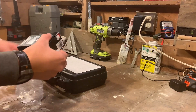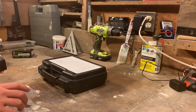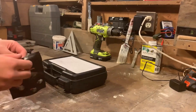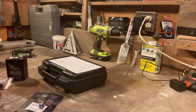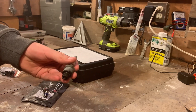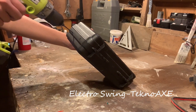I started by making an ignition system that has a few basic components: a battery, a high voltage generator, and a momentary switch. The high voltage generator uses a transformer to step up the voltage from 6 to around 100,000 volts, and that's more than enough voltage to jump the gap of a spark plug, so the spark plug can be used to ignite the fuel in the combustion chamber.